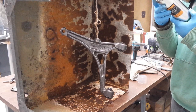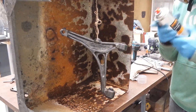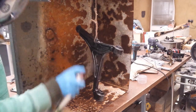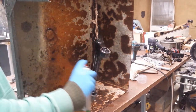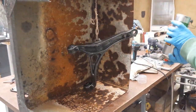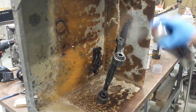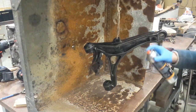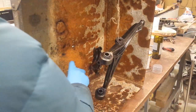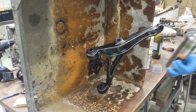After that we're set up in our little indoor enclosure — it's got to be indoors in this winter weather. Because I really like the look of it as it is, I'm just using a clear lacquer, just so it won't rust indoors — it's a UV resistant one. It gets three thinnish coats, and same with those two little mountings we made. More thinner coats are better, but they'll take time.